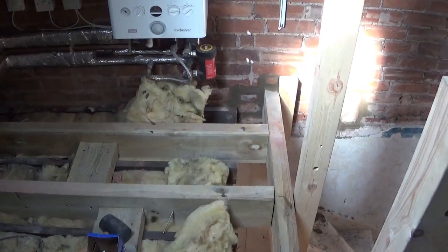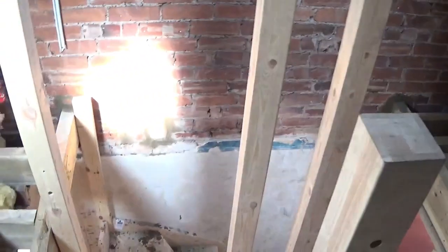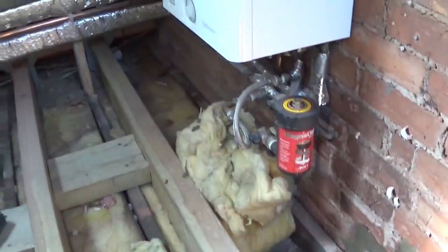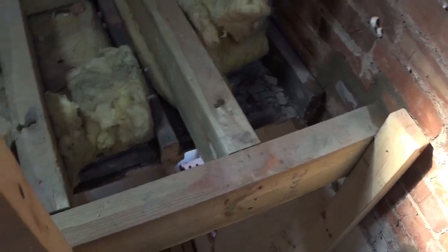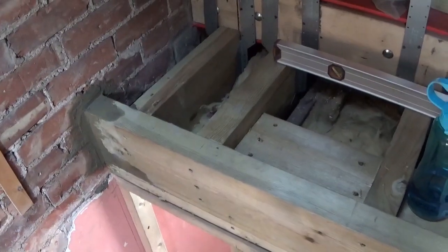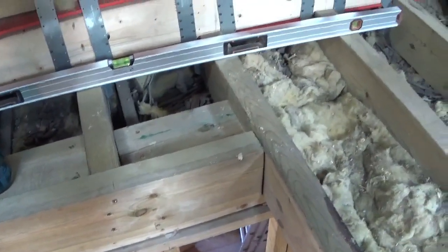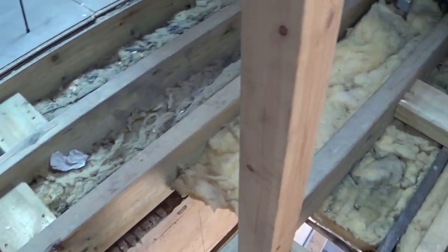And so I've tidied up the brickwork around there and over there. It's a little bit overexposed with the sun there actually. And the brickwork there. So now I've got a final joist to put in under the boiler there. And we need to dress the original ones in. See over this side, I've already got the original ones dressed in there at the bottom. A little bit to do over there behind that arras chair. Definitely taking shape.